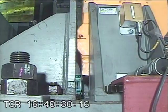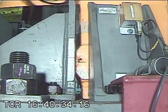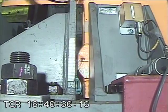This rocking frame is a little bit different in that it also moves laterally, but it also rocks upwards. If you happen to be standing next to the rocking frame, you're going to feel the floor around you kind of being lifted up, because the column is rocking upwards — and that lifting up might be on the order of three or four inches in some of these extreme earthquakes.